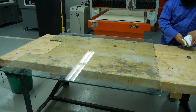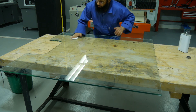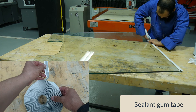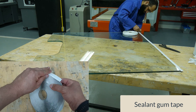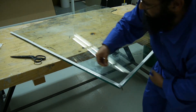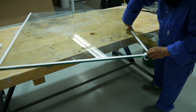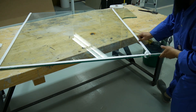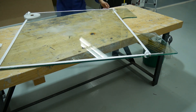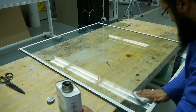In our tutorial we are going to use a flat thick sheet of glass for creating the carbon fiber laminate sheet. Now we start cleaning the glass from the dust. Now I start applying the sealing gum tape all around the perimeter of the glass sheet, which should be a little larger than the size of the dry reinforcement. This is also known as tack tape, used to create strong seams between pieces of vacuum bagging film. Here we start by applying the chemical release agent all over the surface.